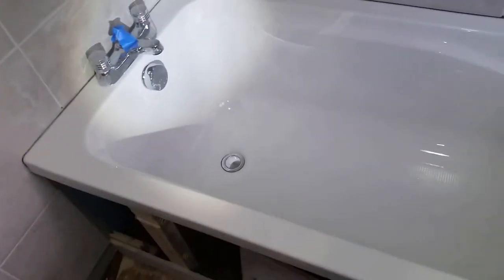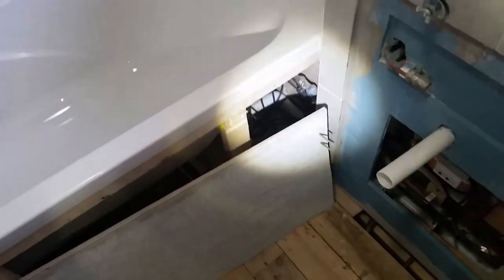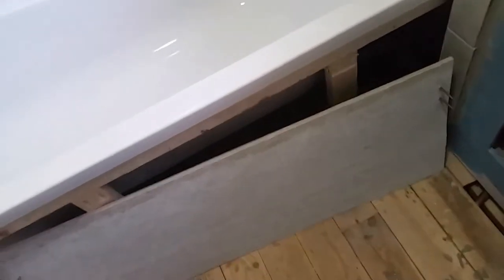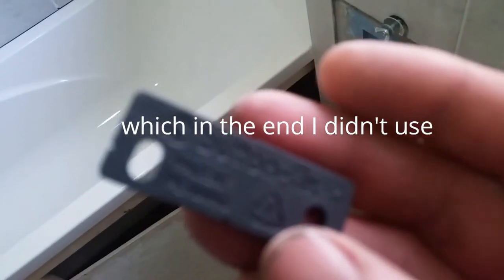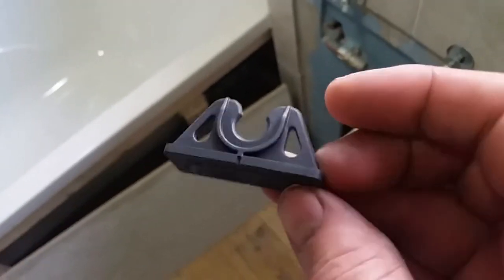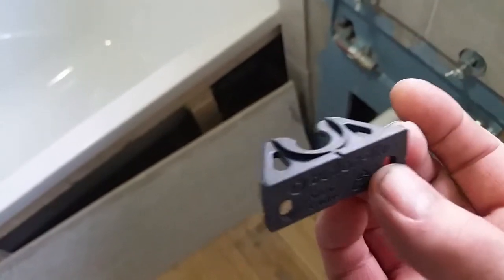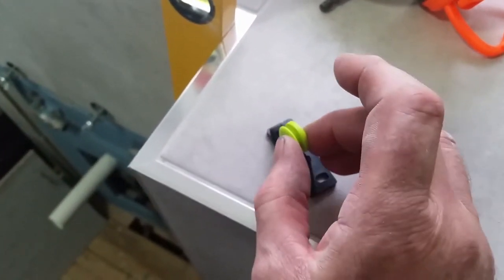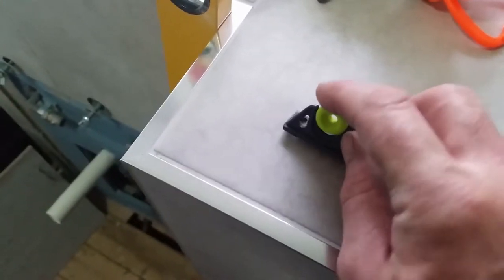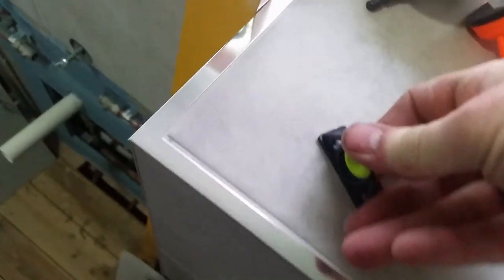At that end I'll zoom in — there are the two stop taps. If you want to change the bathtub etc., that's where you switch the water off, and to get to it obviously you need access. I thought about how to make it removable and came across these, which are called button fixes. The idea is the bracket is screwed onto one part and then these clip in between them.